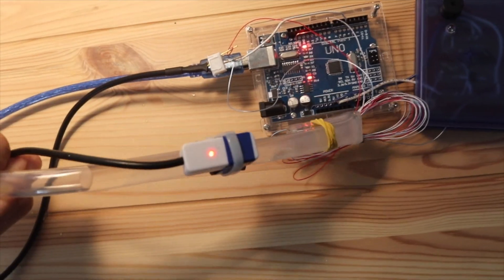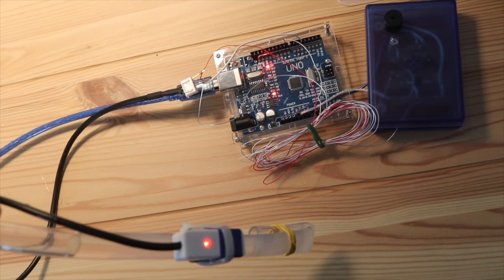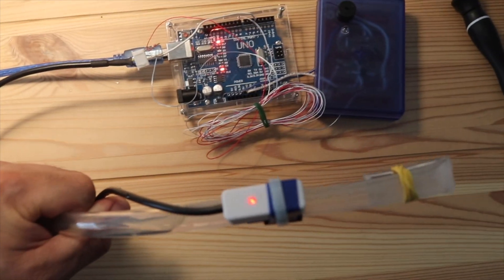To make it turnkey, you load your code text file, then type this block of code: apostrophe water, apostrophe boot, exclamation point, and the rest of the code you see there. After the last line, hit enter and you've got it. Now we have the circuit up and running. Here's a test with a piece of clear hose so you can see the water in the hose.